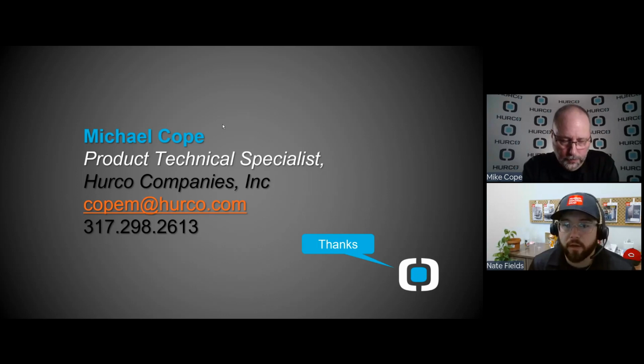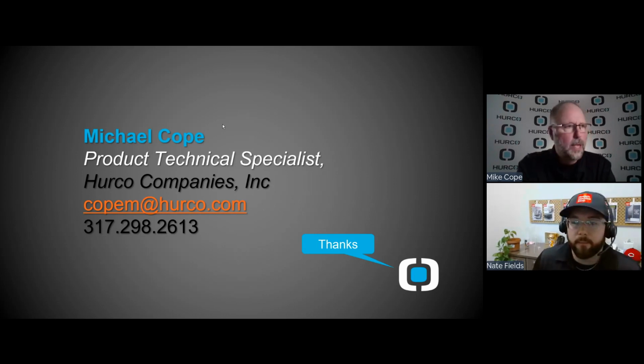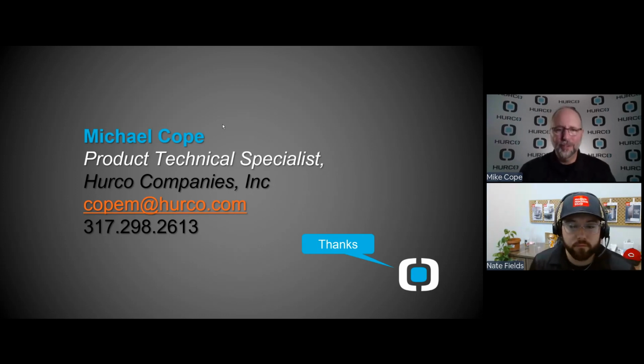Gotcha. And next up, how much experience do you need to operate a 5-axis machine? Can someone who is new to CNC with little or no experience run a 5-axis machine? Yeah. Absolutely. So going from 3-axis to 5-sided machining, again, we're taking all of the tribal knowledge or the knowledge that you're going to need to do simultaneous out of it. So we're going to touch the tools off same way. You're going to pick up your part 0 wherever you're referencing your work offset, same way.